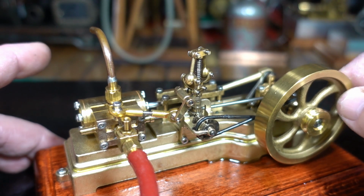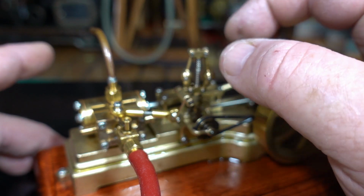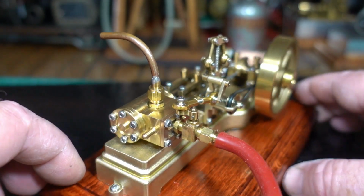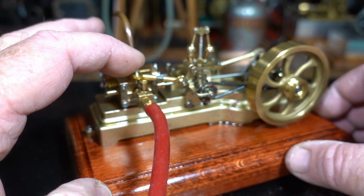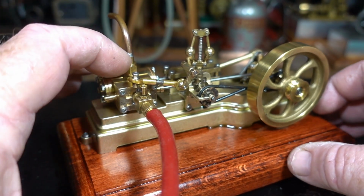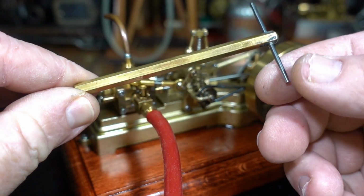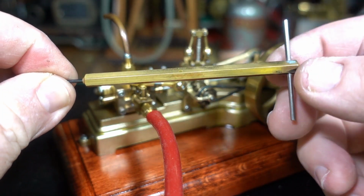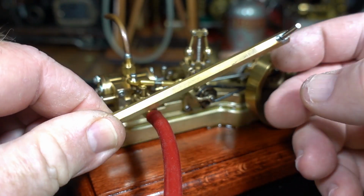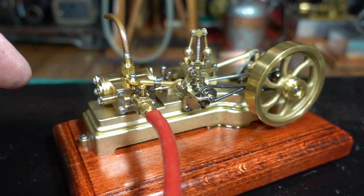I don't know if it's faulty or it's just the way it is. I'm not sure if that spring is too powerful or not powerful enough. But you can see these little hex screws that Microcosm have used. I have taken this apart countless times. I've spent way too long adjusting things on this, trying to get the governor working better. Instead of the normal Allen key, I made one out of a bit of hex brass, put a T-handle at the top and cut the Allen key off, to make it easier to take this apart. That's how many times I've taken these screws out